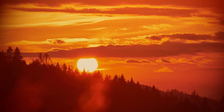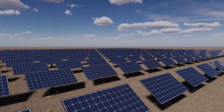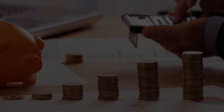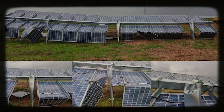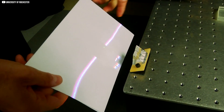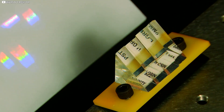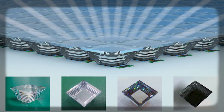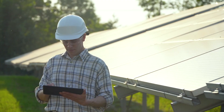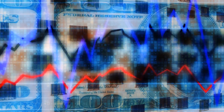The Sun never stays still. From dawn to dusk it glides across the sky, and for lens-based systems that movement is everything — without correction the concentrated beam drifts off target, wasting the light. That's why solar trackers exist: devices that tilt or rotate panels to follow the sun. Some use a single axis, others dual; some are motorized, others passive. But all add cost, complexity, and wear — moving parts break, electronics fail. That's why researchers explored new ideas like the graded index lens, which bends incoming light from multiple angles to a single spot without moving. But these lenses are big, costly, and difficult to produce. In many ways, tracking is still concentrated solar's weak spot.